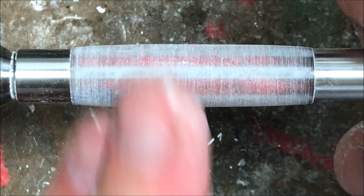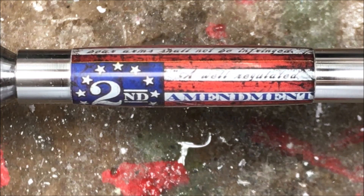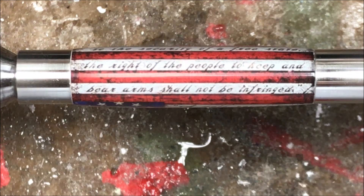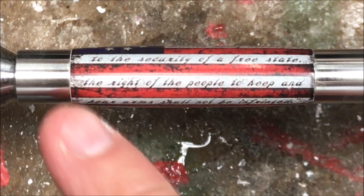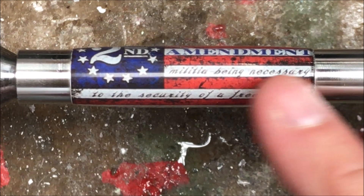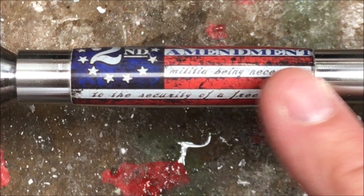I want you to take a look at the surface of that blank — it looks absolutely amazing. Even after running through five grits of sandpaper to shape it up and clean that little lip, I ran through all nine micro-mesh pads and they took every scratch out of this blank. I have an incredible fit at both bushings, there's absolutely no lip. This was a brand new set of bushings so they should be exactly the right diameter, and the fit is amazing. I'm going to go ahead and put a little Renaissance wax on this blank, and then we'll buff it up on the buffing wheels.